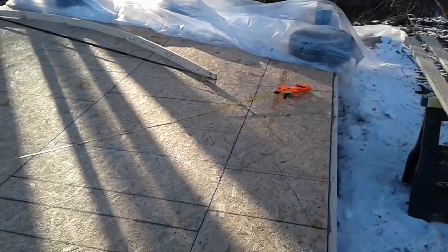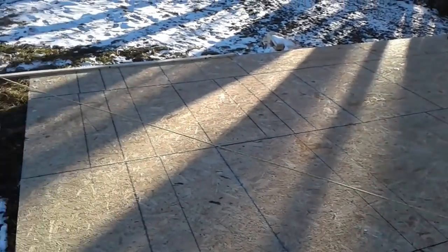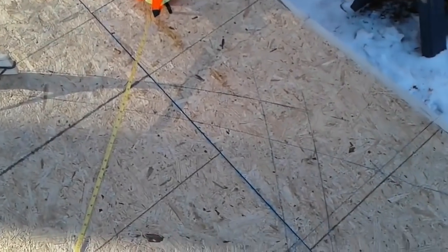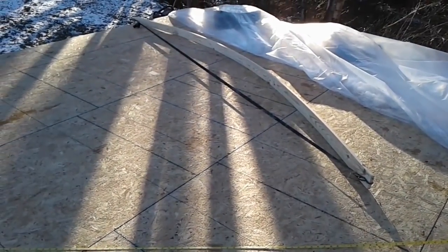I'm back on the shop — actually on top of the shop. I'm planning on making a gothic arch building, 16 by 20 feet. I'm outside today scribing my arc lines on the deck. Even though the building is 16 feet wide, to get the height I want I'm using a radius point two feet off, so it's an 18-foot radius. I use my long tape to describe an arc. I tried a 17-foot radius and an 18-foot radius, and the 18-foot gives me the right length to most efficiently use my metal roofing.